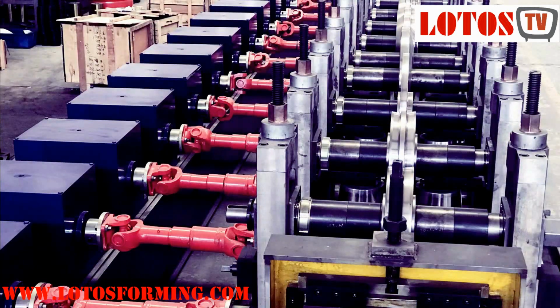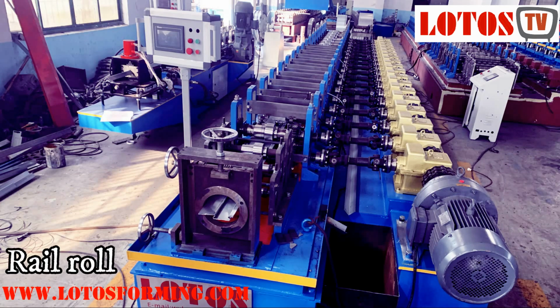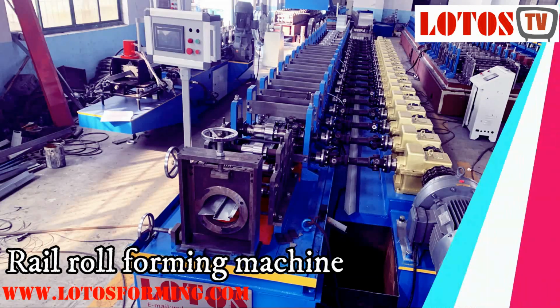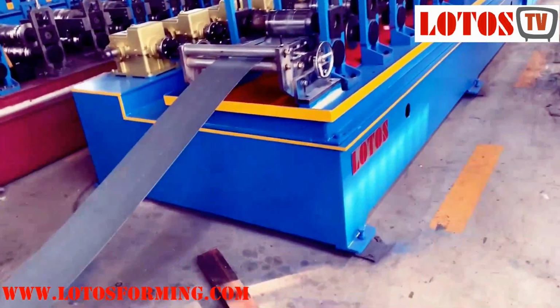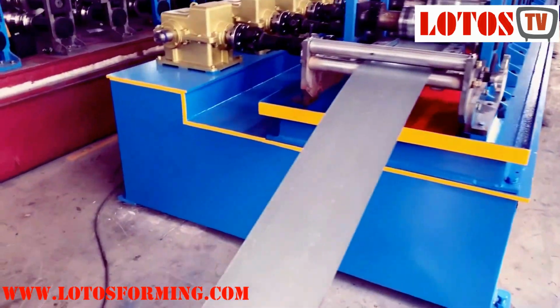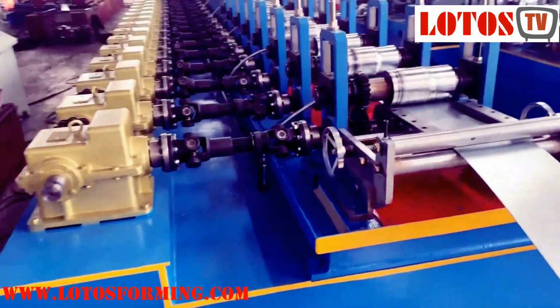Gear drives. Same as chain drives, the adjustability of the top shaft is also limited. Lifting the top shafts a small amount causes only the tips of the gears to touch each other. It will easily clip and break the teeth of the gears. Finally, it will influence the quality of the product.